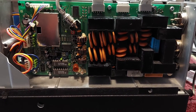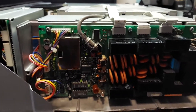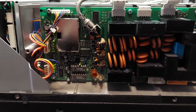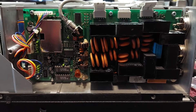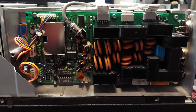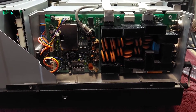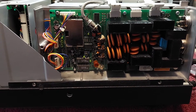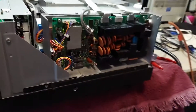After much mucking around I removed one of the supposedly defective relays and found out there's nothing wrong with it. The controller chip appears to have issues — it's not driving these relays. There's voltage out on the pins but it's apparently going into some sort of current limiting mode. I pulled the relays and tested them on my little power supply and they latched just fine. So the easiest solution is probably to find another tuner and replace it and be done with it.